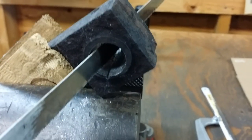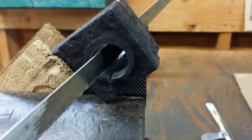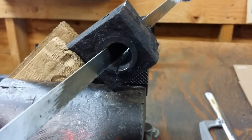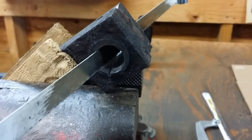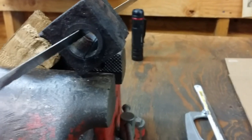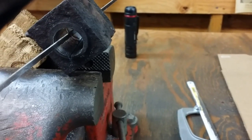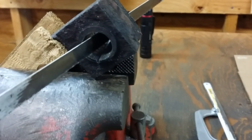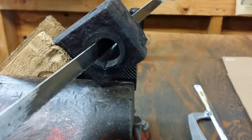I made the first cut and it looks pretty straight. I tried to make sure I did not go beyond the piece of bar stock - I didn't really want to cut into the knuckle too much. I'm going to move it around and make another cut somewhere in this vicinity so I can attempt to knock out that section and ultimately break this free.